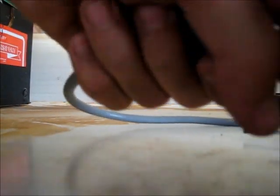Pop the shrouding on - pretty easy. When you pull, this should not withdraw from that socket. Active on the left, which is brown - which is here. So that's the right way around. That's how you wire it up.